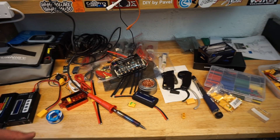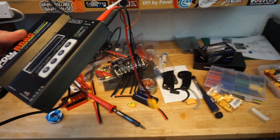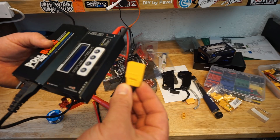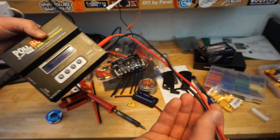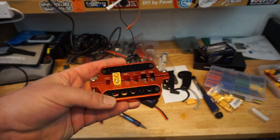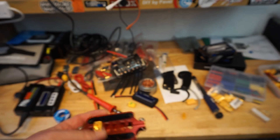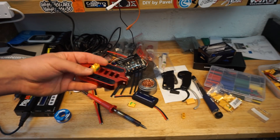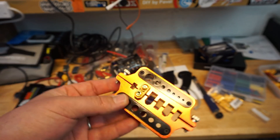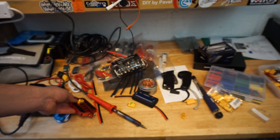It's quite simple when you follow the procedure. Quite important, obviously, to have a good quality balanced charger for your LiPo batteries, and also to get an adapter that actually fits the battery you're using. The LiPos I've got have an XT90 charging adapter, and I bought one of these leads — quite cheap, about $4. Also, I bought one of these handy little tools to keep all the connectors in place when soldering the XT90s — it's quite heavy so it doesn't move. I've got a full review of this tool on my channel.